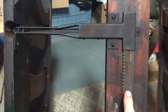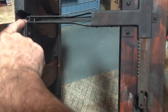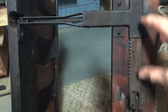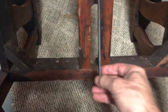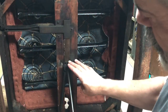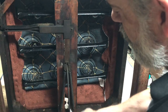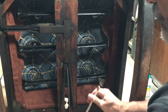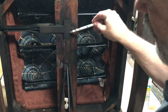This is the gear I'm talking about — this is the rod that goes up through the arm, comes down here, and pushes against here, which allows this to slide back and forth. This down here attaches to the chair, so that rod will go back in once I get the back on, and these springs return it to the upright position. The arm that goes up through the back of the chair comes out here and attaches to this bar, so as it goes, this will slide up and move the chair back and forth. This is the entire mechanism.